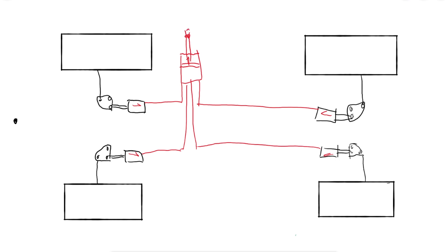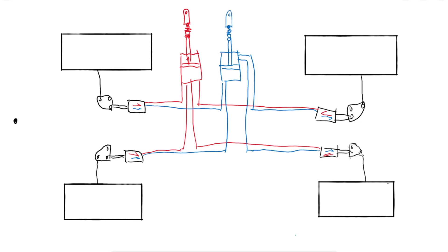I put a big arm on that heave piston and fit a spring and damper unit to the arm — this is our heave spring and damper for the entire car. Next I attack the pitch mode separately. For pitch, fluid moves up on the front and down on the rear, or vice versa. I create another piston routed so that when fluid drains from the front and enters from the rear — the pitch condition — this piston moves up and down. We then put a spring and damper on that piston to control pitch stiffness and damping.